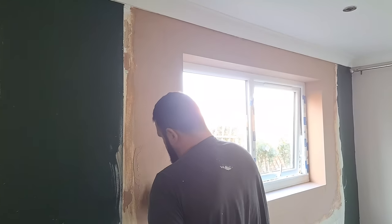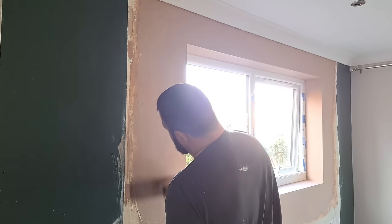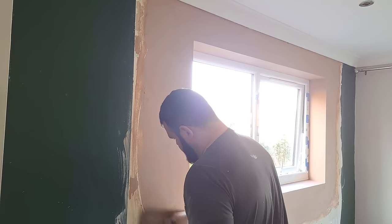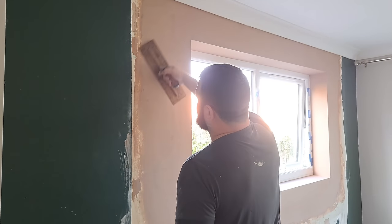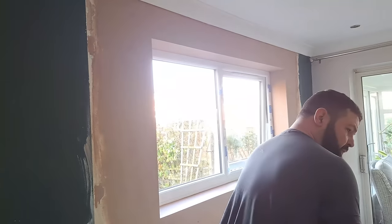What you do is you work the fat up on the plaster and keep going across it, and eventually it'll just stop dragging in. Work away from the plaster, don't keep dragging into the plaster, but work away from it a little bit, and it won't pull chunks of the stuff into your work. It's hard to explain, but if you've experienced it, you'll know what I mean.